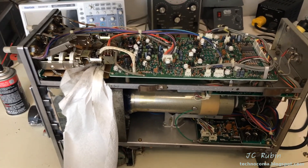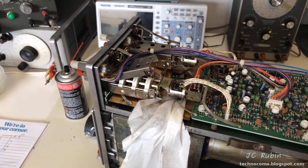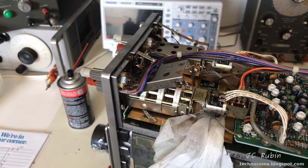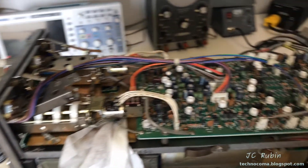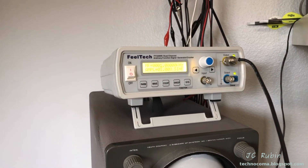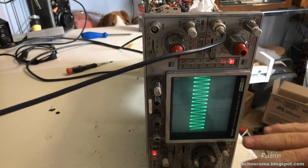I've taken the cover off exposing the components inside. We can see obviously the CRT — I've got to be careful not to damage it — and about eight million different adjustable pots. I started with cleaning the pots up front using DeOxit, as well as these up here that I've had to open to really get inside and clean. I've switched over to the function generator, still using one kilohertz one volt peak-to-peak but switched to sine wave — it displays nicer on the oscilloscope for the testing I'm doing.